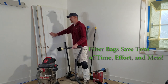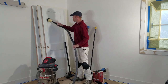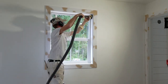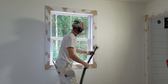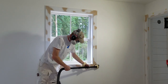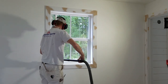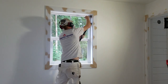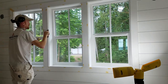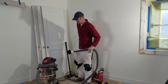When we have all our sanded surfaces we create a lot of dust with our prepping, so we do a lot of cleaning. A slow vacuum doesn't work too well — we've got to be able to move fast. I hook my dust brushes onto the extension and dust the surface pretty rigorously to scrub the surface dust off. This thing gets into corners pretty well, and I always keep a brush in my back pocket to help in some of the corner areas. Especially when doing windows with lots of tight areas, we dust things down before filling, caulking, and before any primer or painting.